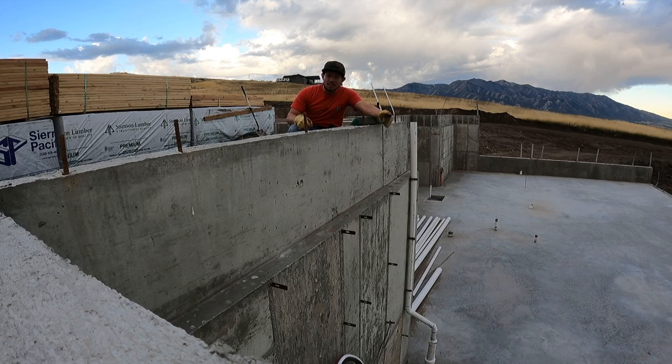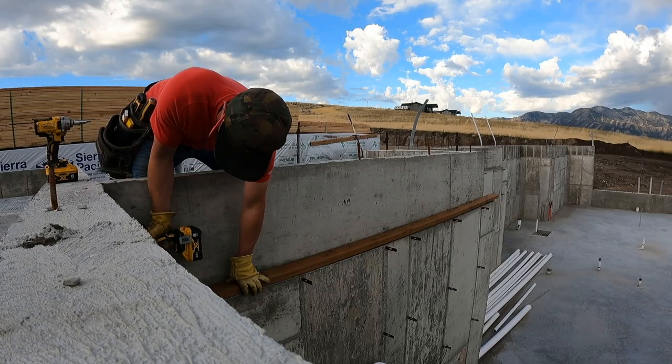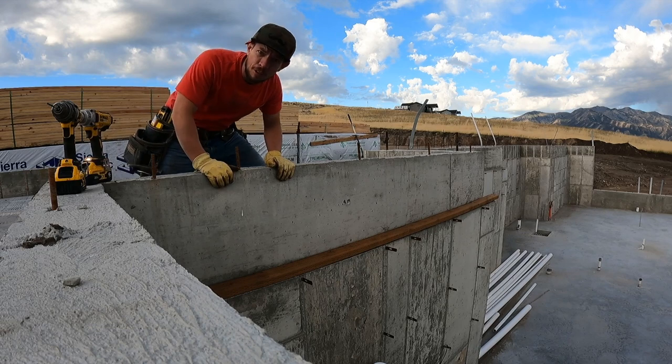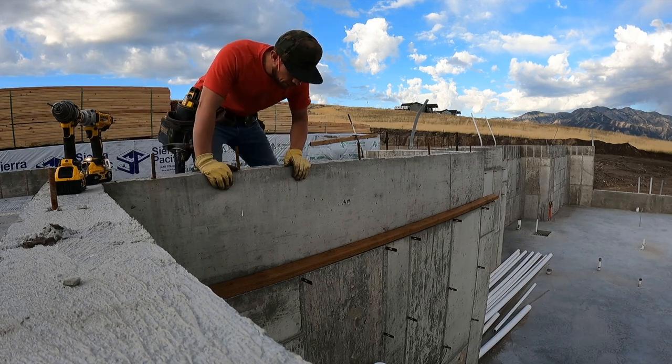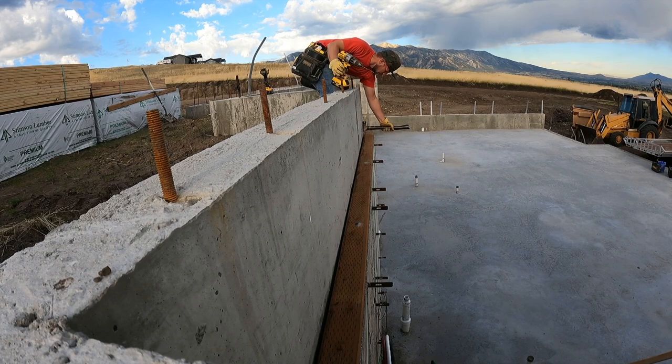Because it's on the inside of the house, I don't have to put any kind of foam seal underneath it. That will go on top of this wall because this reaches the exterior. Well that's it guys, that's the first piece of timber attached to this house. It's all uphill from here. The board slightly bends back into the house, and since I want to just keep it flush with this outer wall, I'm just going to put a pry on it a little bit.